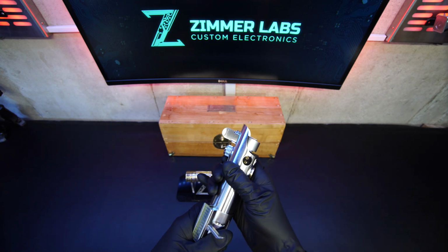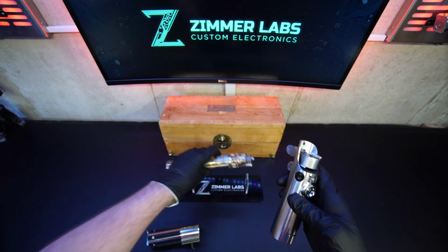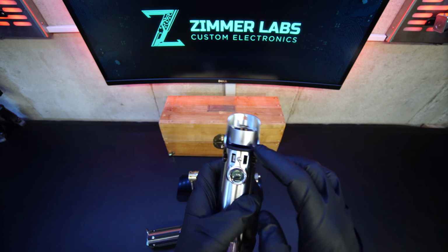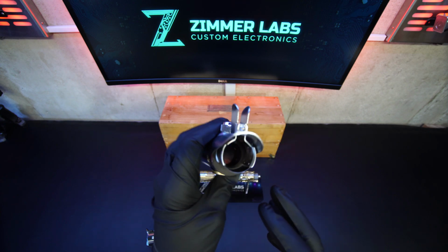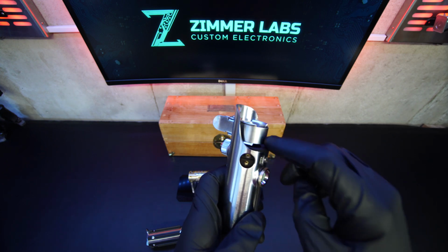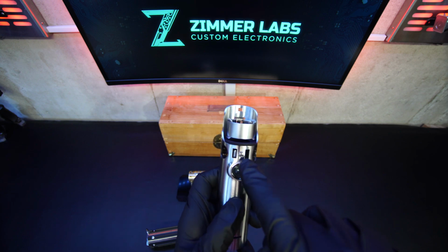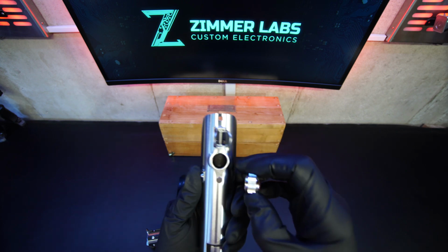I'll show you the other part of the blade holder. Where this ends, there's still more which remains mounted up here in the hilt itself, and with this setup, these pieces are plastic instead of metal, and I was a little bit leery of that at first, but once I received them from Shapeways and installed them, I was more than happy with them. It's a 2-piece set which you attach together and then use a couple set screws to permanently attach, and then you mount the brass pins and the screw and the little window details and whatnot, and it works just the same way as other ones.